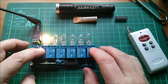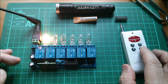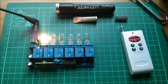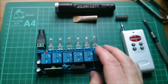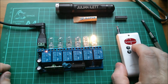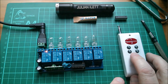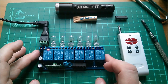One way I could do this is sacrifice one channel and use this as a five-channel unit — when you want to switch it all off, go to the sixth channel and have that disconnected from the relay. The easiest way to do that would be to lift one of these pins out of the socket. Let's try it. Pin lifted out. Let's see if it works. Channels one, two, three, four work; five doesn't do anything — that's the pin I've lifted. Six works. Channel five releases any other channels that are on, but can't drive a relay, so it should be in a low-power state.